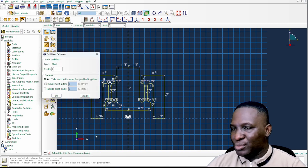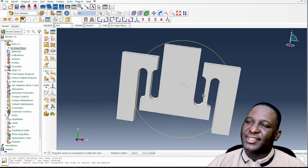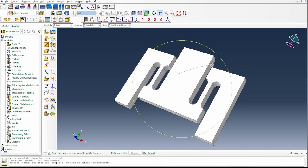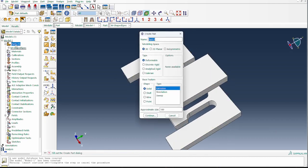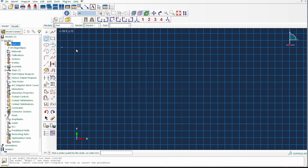With a thickness of two, that gives us our M-shaped specimen. Quickly and immediately we are able to design it. As noted, the specimen will be under compression at the two anchor points while the middle section sees tensile deformation. There will be a separate video on the actual modeling. For now, we're just creating the design. We also need to create the bars, so I'll create one called 'incident bar,' with a diameter of around 15mm and a length of 100mm for modeling purposes — the specimen itself is only about 20mm.